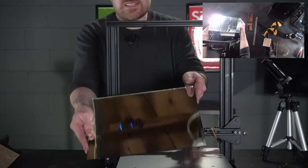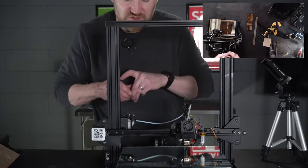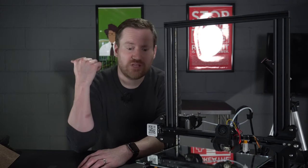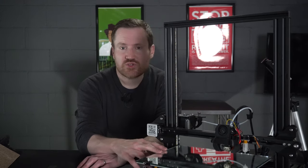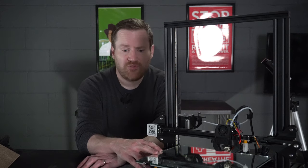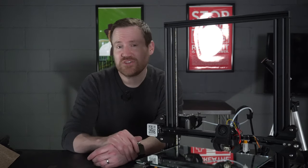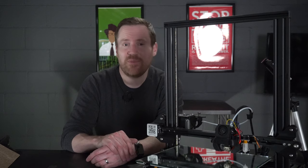Here's the piece that I did previously, and you can see it matches my build surface perfectly. We just simply line this up and put our build surface clamps back on. At this point you should have a nice flat surface for your printing. This is quite possibly a different thickness than your old glass, so you'll want to re-level your bed. Also check your Z offset. It is extremely smooth, so you may find that using something like Magigoo or putting another build plate on top would be helpful. But I found that this solved several of my leveling issues with dips in the glass.